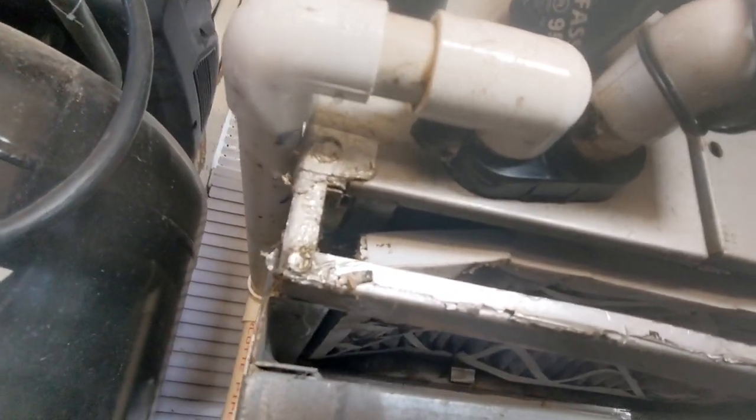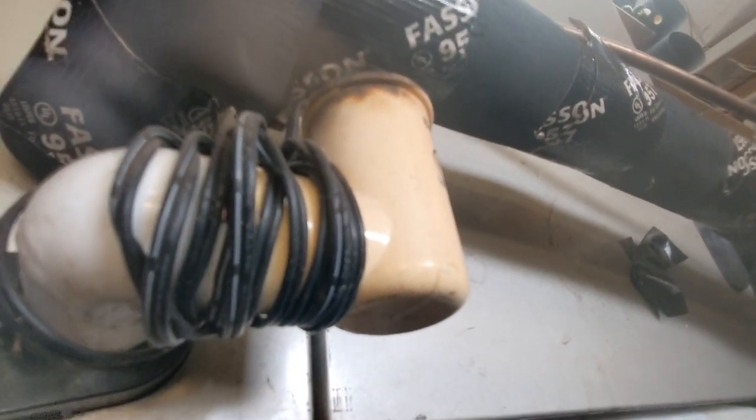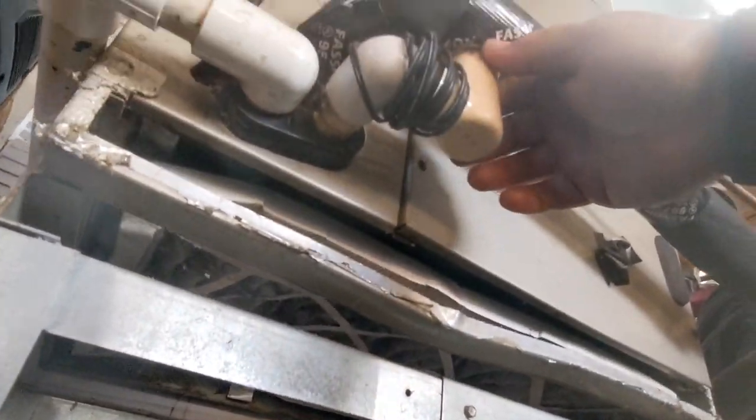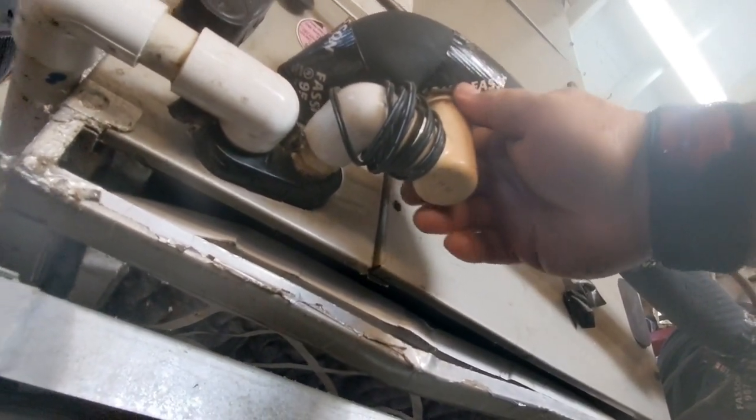and I won't have to worry about dealing with this damaged cabinet. Another trick, I've got my drain set up to run outside, of course. When you have these float switches like this, which I don't have hooked up because we're just in a garage, you can use this as an access port. Well, this one, the line set's in the way, but you can see how the float switch comes out of that cup.